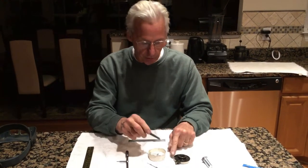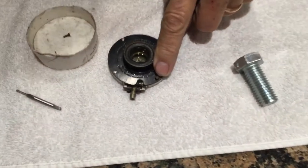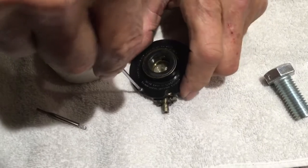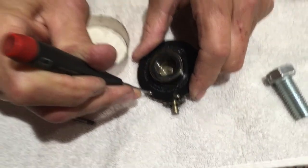I use a jeweler's screwdriver that fits the screw slots very well. When you do the screw, you have a slot like this — you don't want a thin screwdriver. You want to push down and turn, because you'll see threads that are boogered out on the slot, and that's because you're not using the right screwdriver. When taking them apart, these get boogered up from dirt and grime or rust — it's steel and brass. You need to push down firmly and then turn the screw. Just don't put the screw in and go like that or it's going to burger out the top and look very badly. You see this a lot on phonographs — even at the factory they did that. I always fix those on machines. It's a lot of fun, and that's my tip for the day.